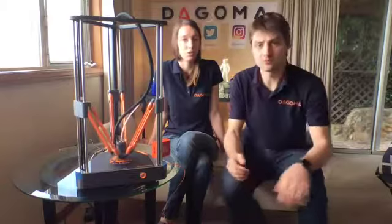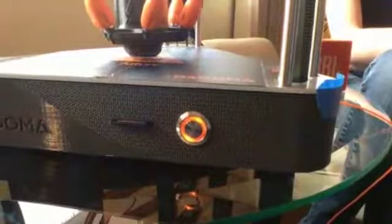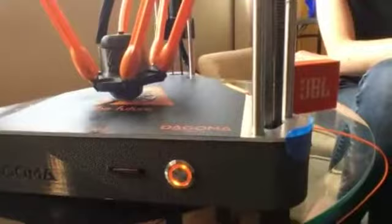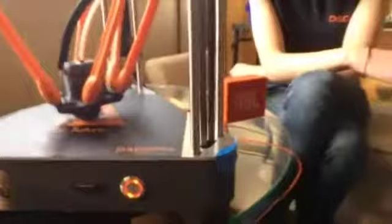After the demo, we want to show you how to remove the filament quickly and use the pause function. As you can see, the printer is pretty fast — everything is managed automatically by Cura by Dagoma for the Neva. The print speed will change according to layer height and other options, but you can go up to 80 millimeters per second, or a little bit faster.